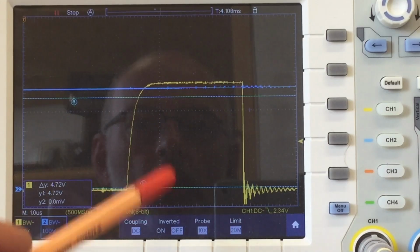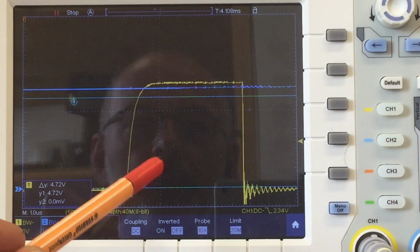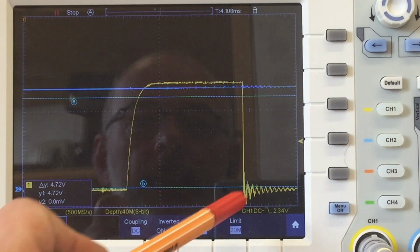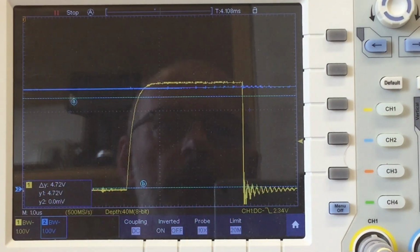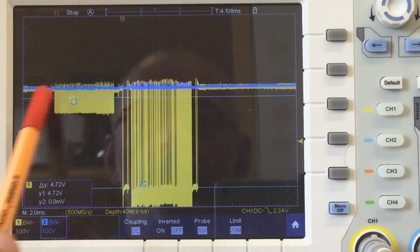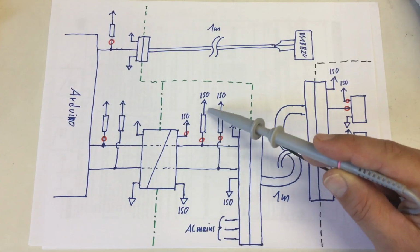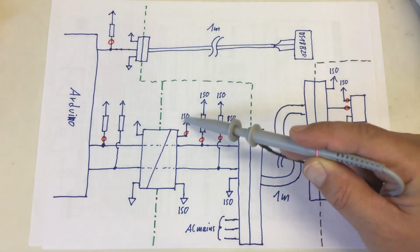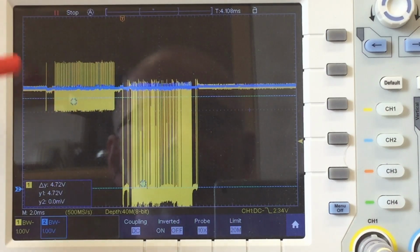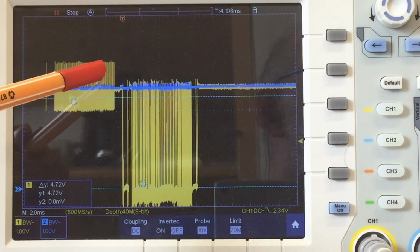let me try to put in, as I mentioned before, a very small capacitor between the data line and ground, and let's see if we can get rid of that ringing here, and foremost get rid of that crosstalk. I mean, this just looks ugly. Didn't move the probes, still here at the pull-up resistor and the power rail. Now that we don't have to zoom in to see that makes things just worse